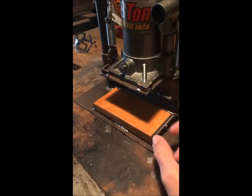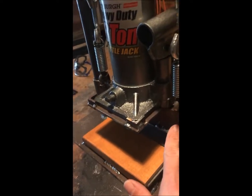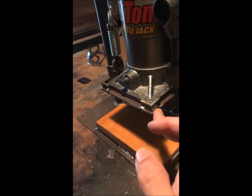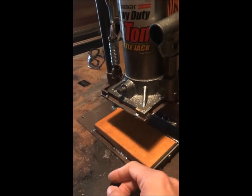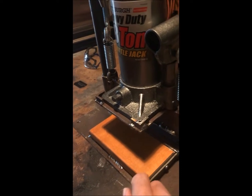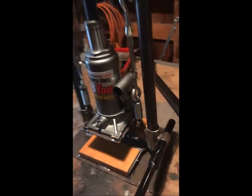This wood I had sitting around, but you can see here, this is just angle iron and a cut fit in here. This is more angle iron. The punch I made out of 1/2-inch thick steel. Platform here, 3/16. I didn't do any gussets on the bottom side. If it was something really super heavy duty, I would have done a triangular gusset on the bottom side right there. But you can see these little guides that I put in. These are just other little snippets of angle iron that I cut off. Here it's just an extra piece of tubing I had sitting around, so this just sits in there when you're not using it.